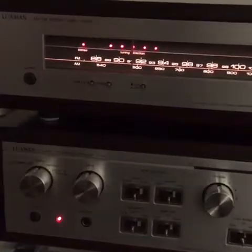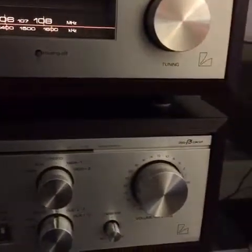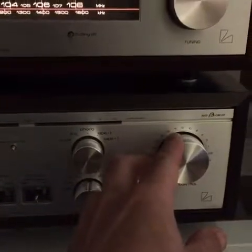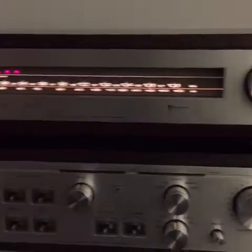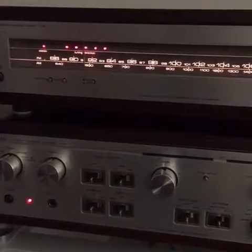The unit does sound a little better now than it did earlier, and there's a reason for that. When I was in agony listening to it, I decided to double-check the DC at the outputs and found an excessively high DC offset of over 100 millivolts. I went ahead and adjusted it — there's no manual available, but it's VR701 for DC offset and VR702 for bias. After that adjustment, the Luxman really came into its own.